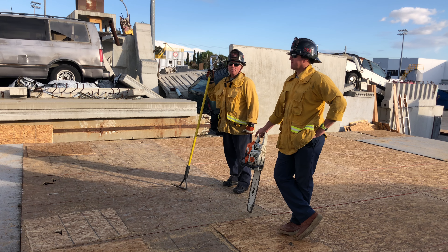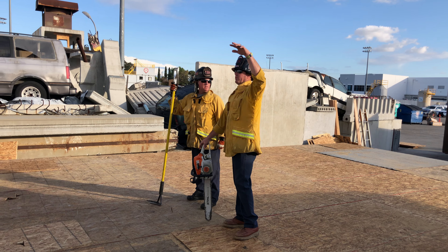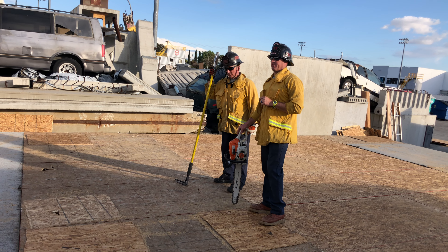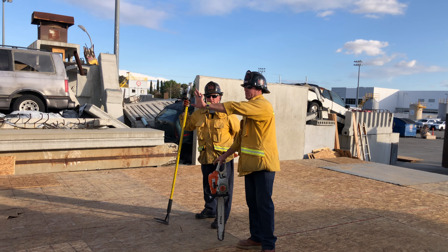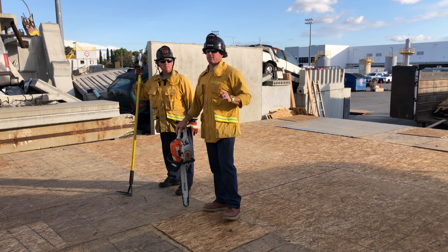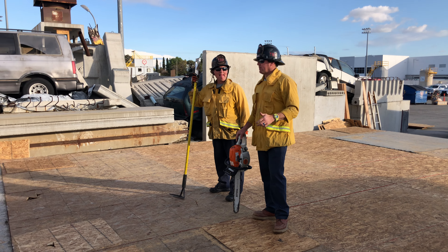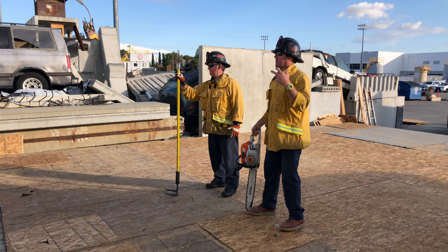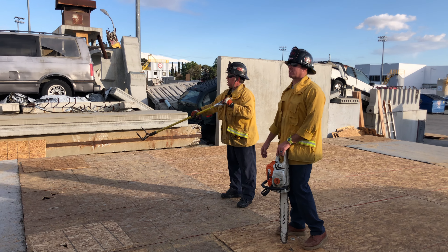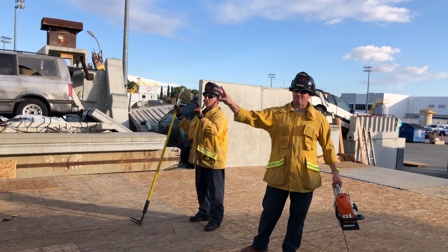The last thing you want is fire coming out of your strip before you're done — it's demoralizing, because by the time you get to the strip cut you've probably already done two, three, or four offensive louvers and you're spent. On a single truck, each person will probably punch five or six panels. Sawyers plug their saws and get their axes out — you can louver these three-by-threes with an axe, no problem. Do not simulate punching the ceiling on the asphalt because it breaks the tools. Stage OSB sheets, six groups rotating through, everybody cuts twice.